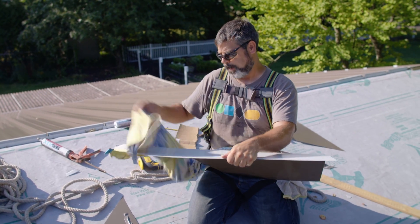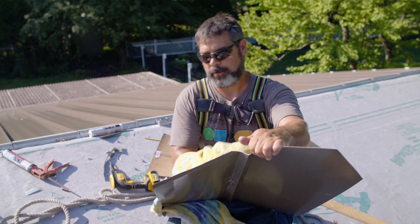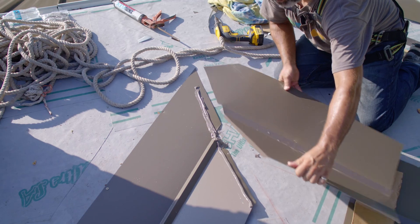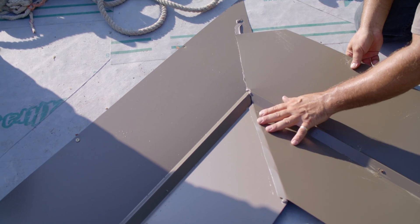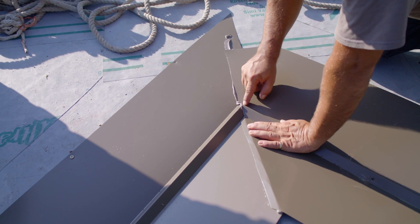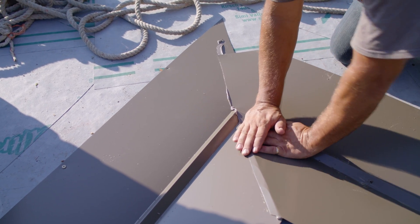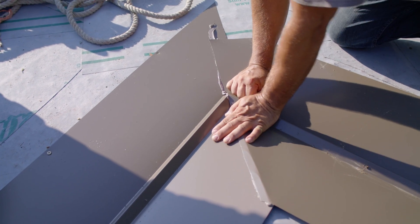We're making these caulk laps. Like so many other things in life, cleanliness is important. We want to make sure when we're sealing this, things are clean. So by caulking the back first, when we set this in, we know that these points are all sealed under here. When we press that down, the caulking is going to seal even tighter.